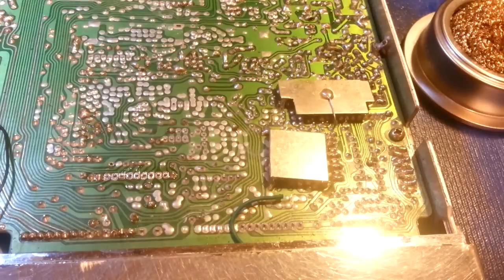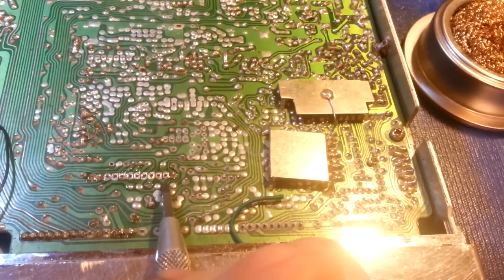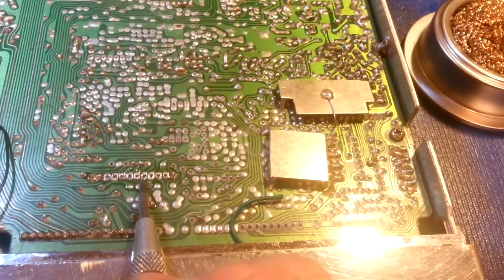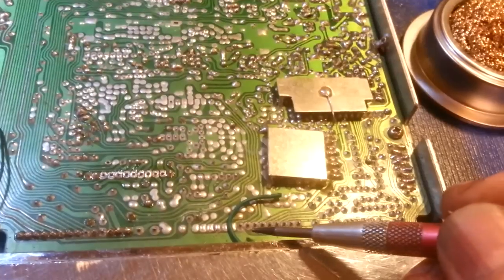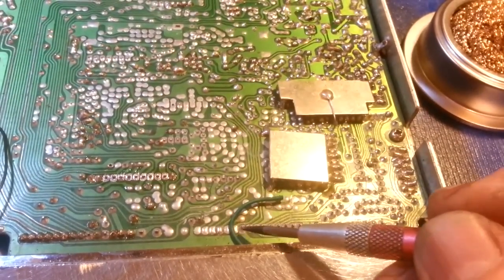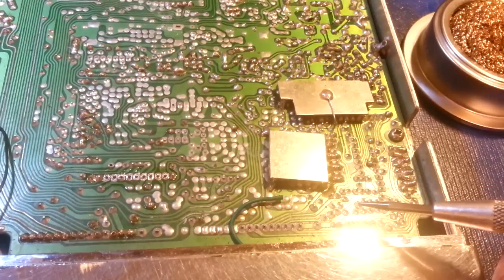Once I've completely inspected the entire board, I start fixing. I decided to include this in the soldering series. With this header socket — the plug was unplugged from the top side — I always unplug the plug from the other side first. You can see how non-shiny these joints are; the lead and tin have oxidized. Rubbing over it brings a little shine back.